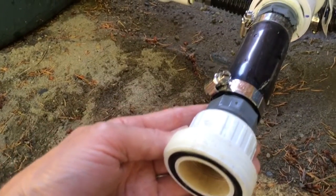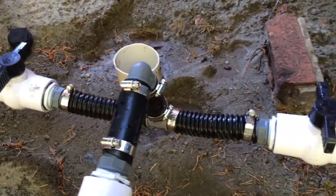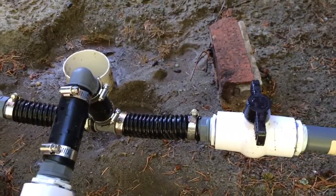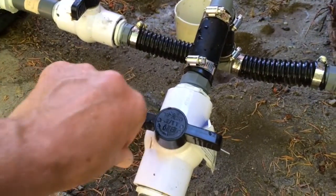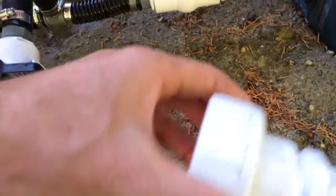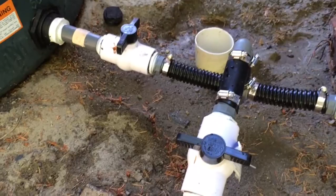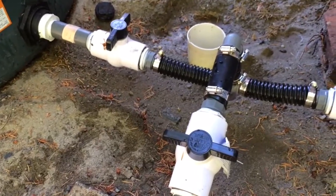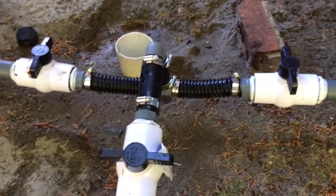They connect on to that other pump, so I can plug that directly into 110 power, open up these valves, open up this valve here — that supplies the pump — and connect on to this line here which leads all the way down to the garden. We're watering vegetables. A bit of a rigmarole but it does work, and not too costly to install or maintain. Hopefully that'll get us through this dry season.